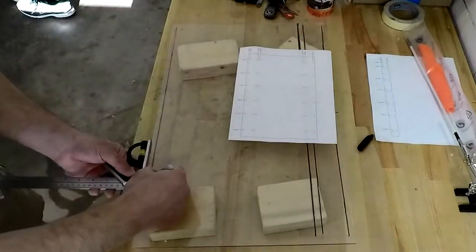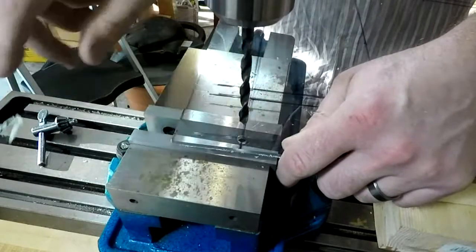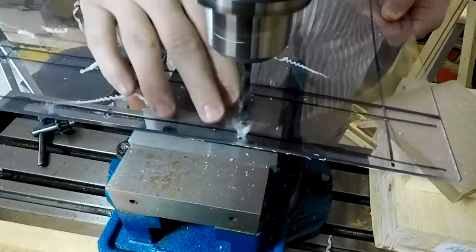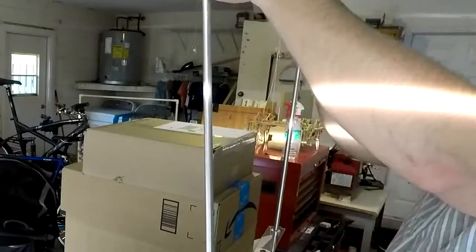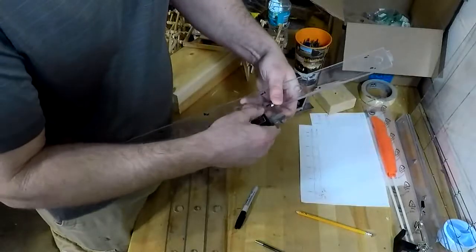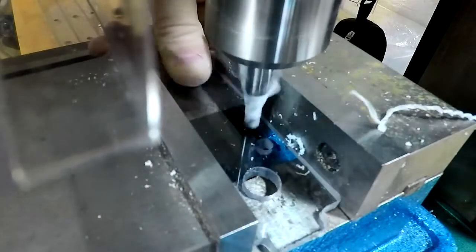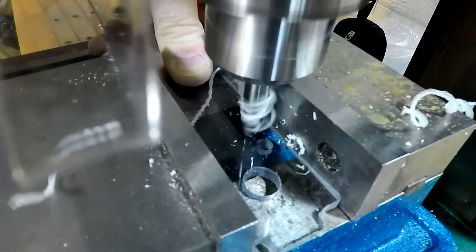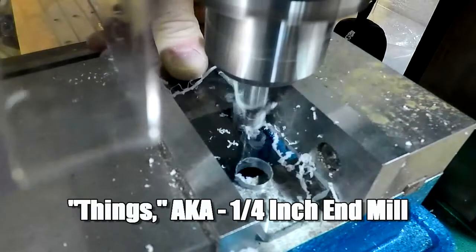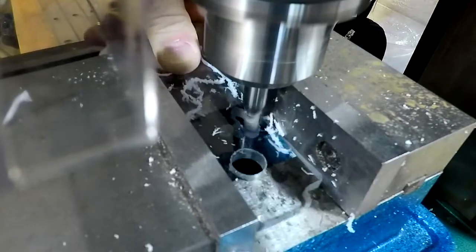The first thing I did was redo the body and actually put a piece of polycarbonate on the bottom so that it would support that better. I thought this would help keep things in line better, keep that coupler from breaking. Once the bottom was cut out, it was time to cut out the side pieces with notches, so that I could slip zip ties in and attach them together. What I'm doing here is a technique called plunge milling, where you plunge down kind of like a drill bit, and then I just went over it afterwards back and forth to clean out the middle pieces.